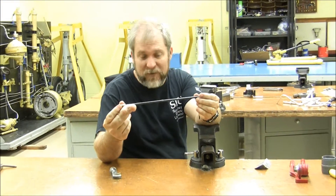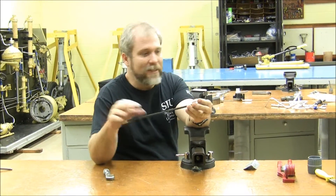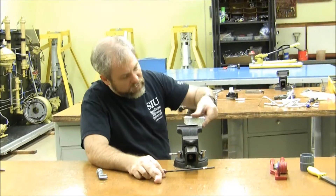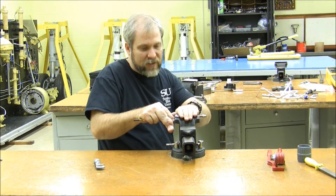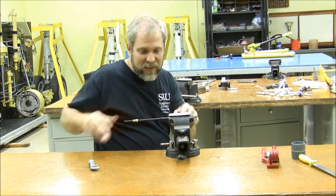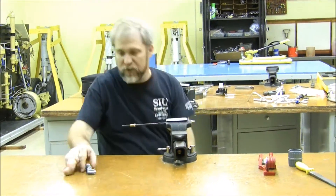Hopefully you didn't damage the tube like I just did, but how can you repair a tube like that? Well, we have a perma-swage machine, and the perma-swage machine does a wonderful job of repairing a stainless steel tube. It actually swages a new section of tube onto that. The way we repair it is we cut the damage off, and then we swage a new section into the tube.